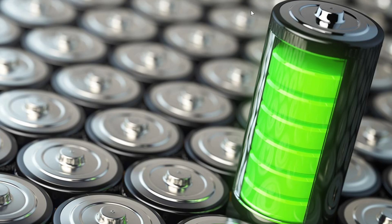If you want your batteries to last the longest time possible, for NiMH batteries, do not buy the fast one-hour chargers. Those charge your batteries so fast that they create an enormous amount of heat inside the battery, which actually degrades the battery faster. You're better off with something that takes four, six, or eight hours, because it's softer on the battery. There's less heat generation, and your NiMH batteries will last much longer if you charge them slowly. With the big one-hour chargers, the batteries become so hot you can't even hold them in your hand — that is really bad for a battery.